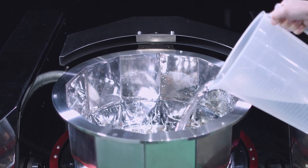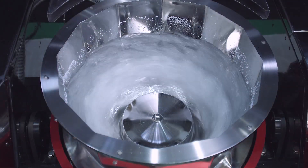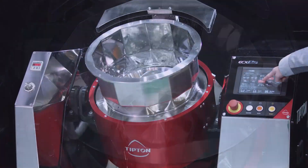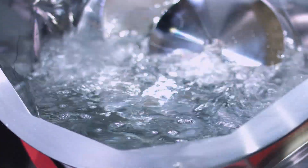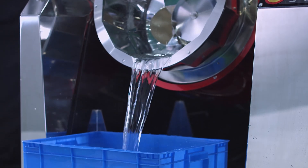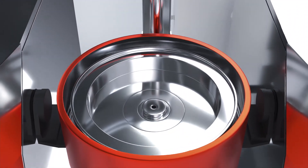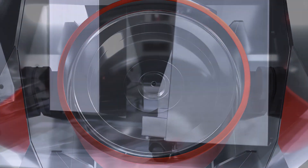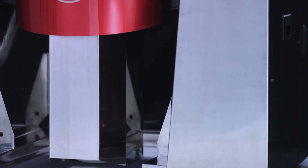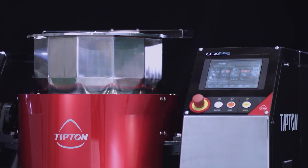Maintenance is also very seamless. After the drum is cleared of the product, water is added and the disc is spun at high speed. In just one minute, the surface is washed by the powerful water current, similar to that of a washing machine. The simple structure with few parts makes it easy for anybody to assemble and disassemble the device, and changing the batch or item is also hassle-free. The ease of maintenance directly correlates with improved productivity.